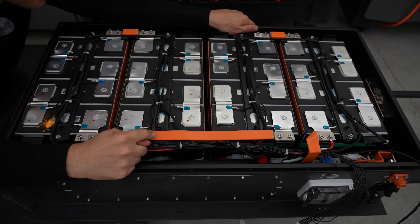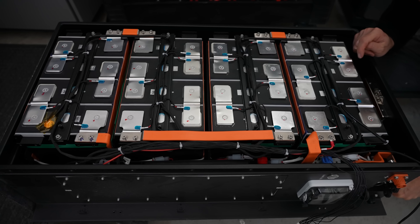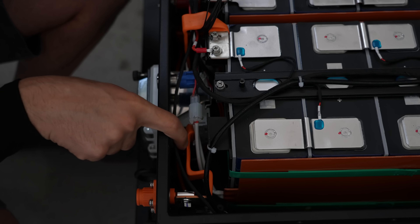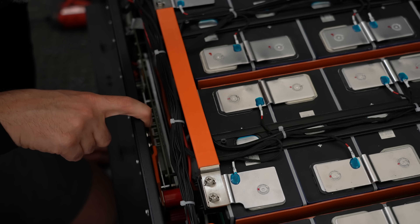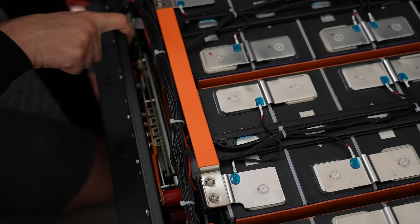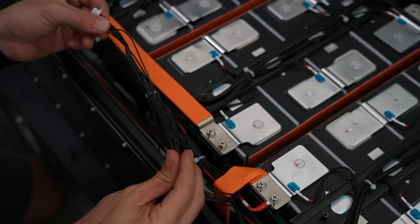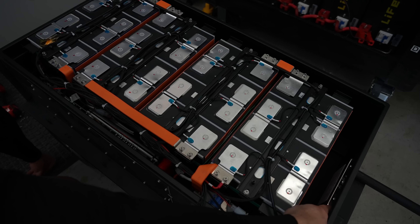The bus bars are quite thick because it's rated for 200 amps continuous. Temperature sensors are mounted straight to the bus bar — there are four of them. The DC rated circuit breaker is huge, with bus bars connected straight to it, and the outside is waterproof. The BMS is tucked in with massive ceramic resistors — four of them, versus the single one typically found in server rack batteries. It also has an inductor, meaning it has a DC-to-DC converter and can throttle charge current down to 10 amps. There's also a cable running throughout the battery pack that connects to a fire extinguisher on top.